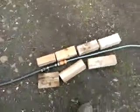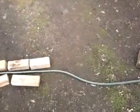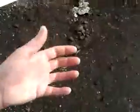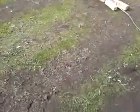The fact of the matter is that I saw a situation where there was a blown connector and they couldn't build up enough pressure in the line, and the whole bunch of these were leaking. The boss couldn't believe it, and he said, well, there must be at least 1 in 5 that isn't dirty, because they get bugs inside. Spiders crawl in there, earwigs crawl in there. We were pumping out a river, so a little bit of mud ended up in the system that'll clog in there, and so you have to wash these diaphragms out. And he said, well, there's going to be at least 1 in 5 that are clean. How come all these are leaking? Turned out it was a blown connector. It was pissing water all over the driveway.